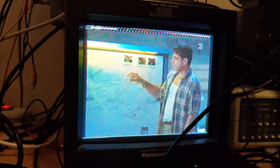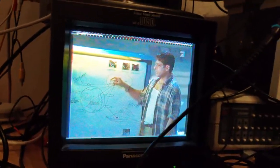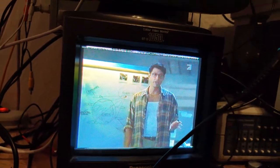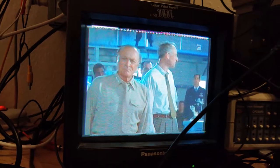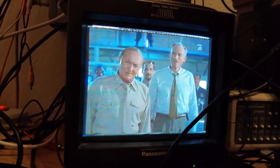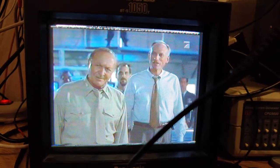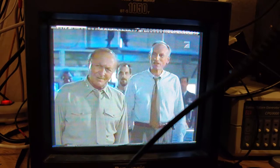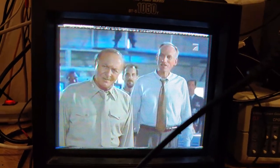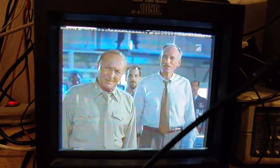but it will never be a perfect frame because it's still analog. The picture is still coming from the head drum that's rotating. What they did in this machine was, I'm going to hit the digital memory button. What you end up with is this perfect digital still frame. It's not a still field like it is in normal analog mode. It's a full still frame.